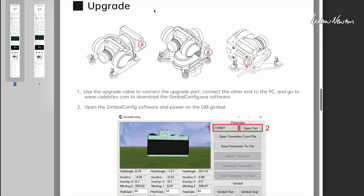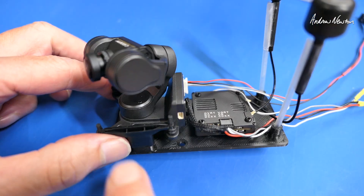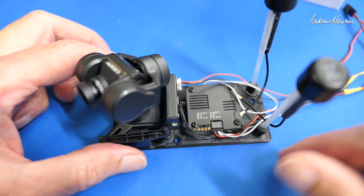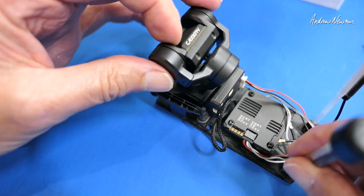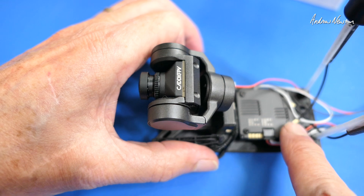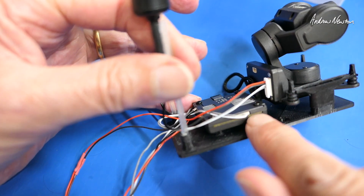You can calibrate and return. Luckily, I didn't have to upgrade the firmware of the gimbal — mine seemed to be on the latest or appropriate firmware anyway. This is the gimbalconfig.exe program you have to use — it's not going to work on my Mac of course, you need a Windows PC to connect and update the firmware. So here's the gimbal and the video transmitter mounted on a 3D printed mount that I made up — there'll be a link in the description for that. The gimbal is mounted up on rubber blocks, so it's very nicely damped on these four rubber supports. This is the three-axis gimbal — we've got roll, pan and tilt. That's the power, ground and RX and TX from the video transmitter going back to my flight control board. And you have separate power for the gimbal. This is the head tracker connection going into the USB port on the video transmitter.